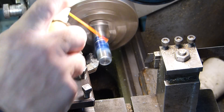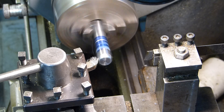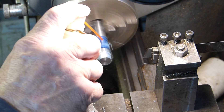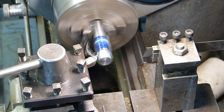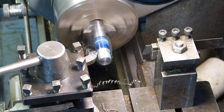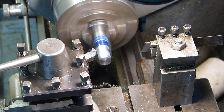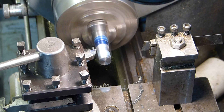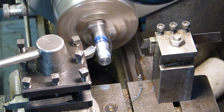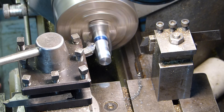I'll just spray a drop of coolant on to help the tool. I don't have any running coolant on this lathe — it's far too messy. I did have a pump and sump but I haven't used that for years; I find this method easier and less messy. This EN16 which I'm machining is a low-alloy manganese molybdenum steel offering high tensile strength properties. It can also be hardened and welded, and it's not too bad to machine either — quite versatile.